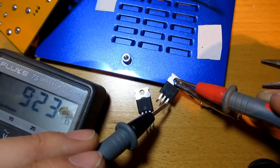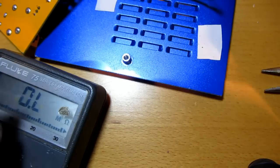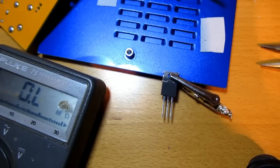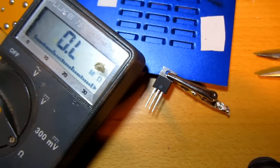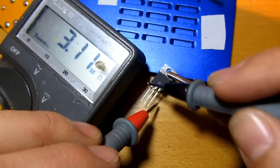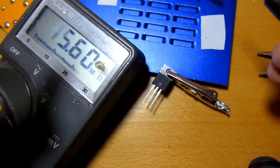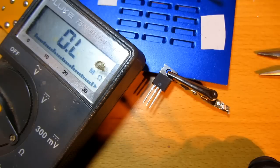No mention about that. Well, let's see the difference on the other MOSFET - so that's the new one. Yes, there it is - three megaohms. That's what I wanted to show you, so there's the difference. The old one had just 80 ohms or something.